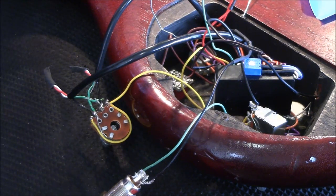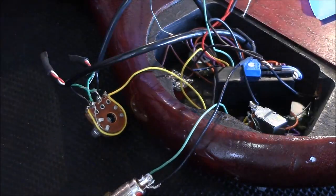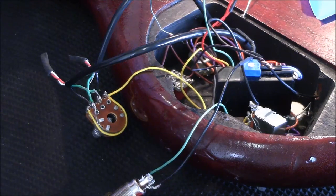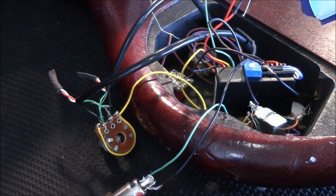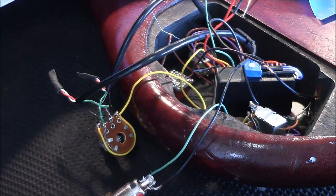Let's see, according to all this, that's a passive, this is active obviously. Yellow back and forth to one another. That's not the way this is wired, so that's not the diagram. Then it shows this wire coming off this volume pot, which makes sense, to the jack. But I still don't see what the hell to do with that green wire that's left there in space. It shows on this diagram 5.4, which is what this thing is, a 5.4 harness, along with this little controller flipper here. Son of a gun. Confusing. I'm not sure what to do with that green wire. That's the only one left.